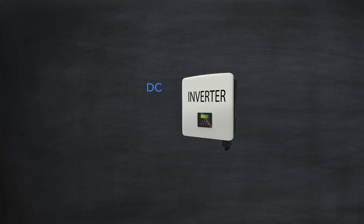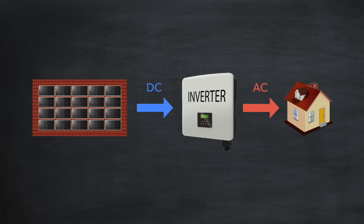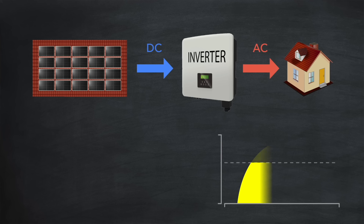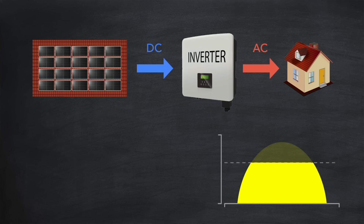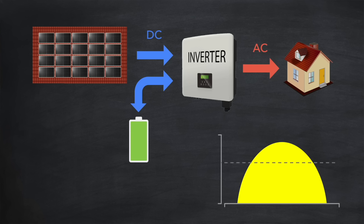Oversizing is also great if you have a DC coupled battery. There are two sides to a string inverter: a DC side and an AC side. The panels generate DC power which is fed into the inverter, which then converts it to AC and supplies your home appliances. Any solar generation greater than the AC power limit of the inverter is clipped. But if you have a home battery connected on the DC side — a DC coupled battery — your inverter can send that extra power straight to your battery, because so long as the extra power stays on the DC side it's not affected by the AC power limit. Watch though, because as soon as your battery becomes full, the inverter can't do anything more with the extra power and so it's clipped once more.